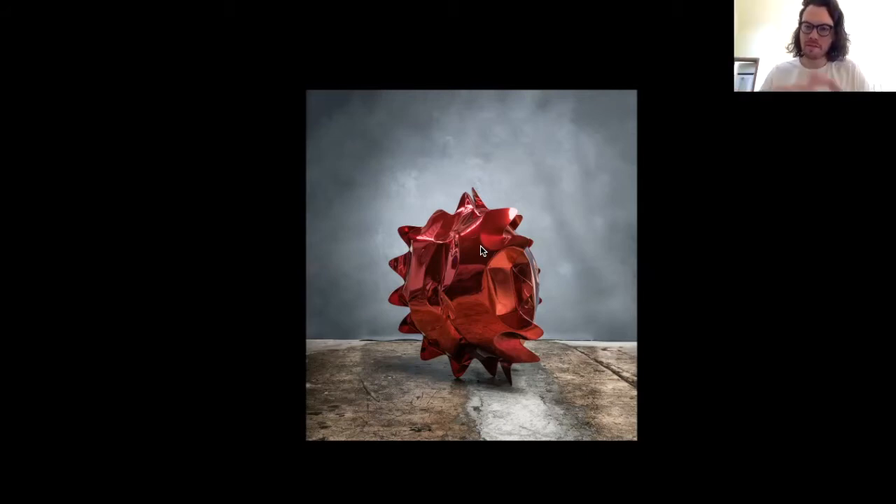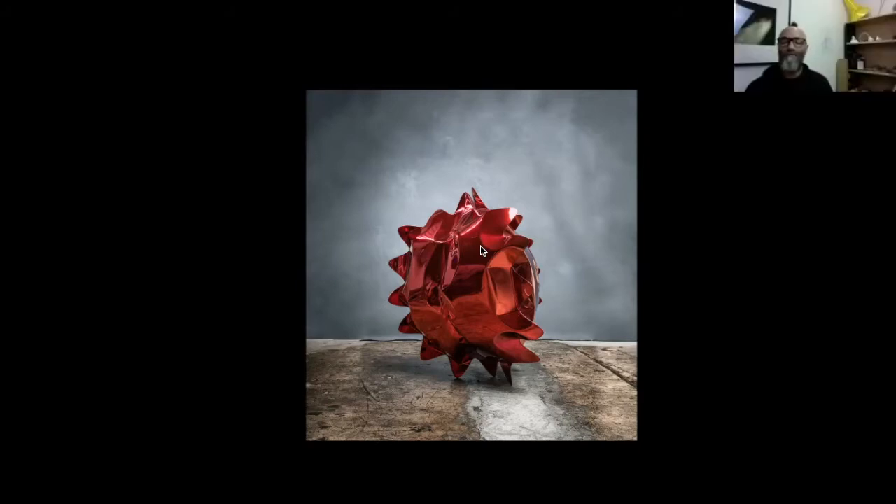So you're inflating the metal like a balloon almost. That's right. It's crazy — the metal's not really stretching. It's stretching a tiny bit, but the welds are giving. Really it's whatever the amount of material in relation to the profile I use — the shapes or profiles dictate the void of the form I can create, or the volume of the form. It's the material giving wherever it can. So that's why you've got all that crumpling. It's not stretching like a balloon.